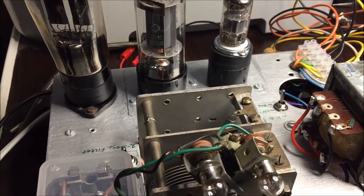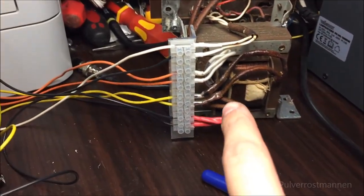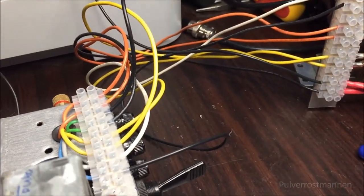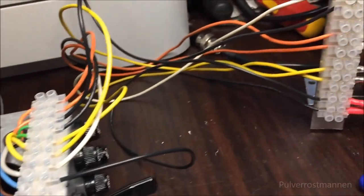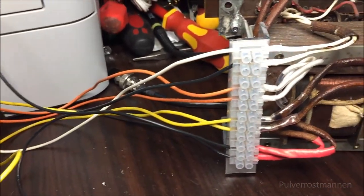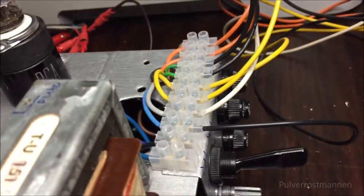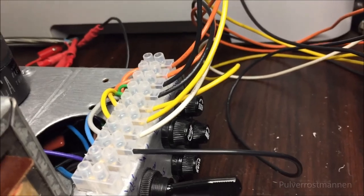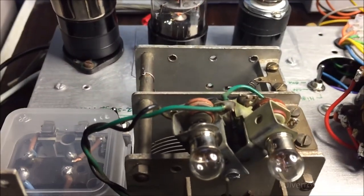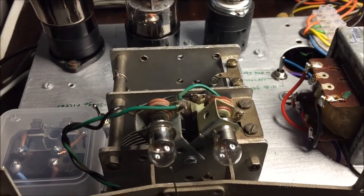And the hum on this one is pretty much nothing at all, even if this transformer here is only halfway rectified, because it's only got two leads out from the 300 volt circuit here, so it will be put in on the separate side here, and the cables will be connected together nicely and firm when it's installed in the chassis. But it can be disconnected easily here by using this connecting block. If it needs service sometime in the future, it can be pretty good to have it there to make it easier to use and install.